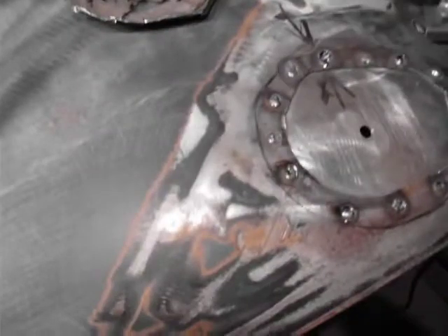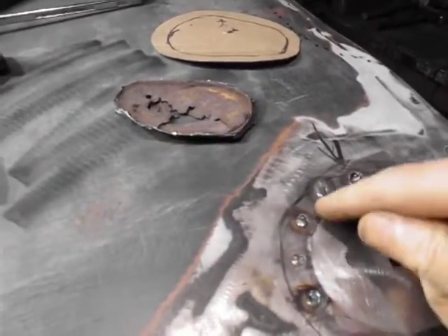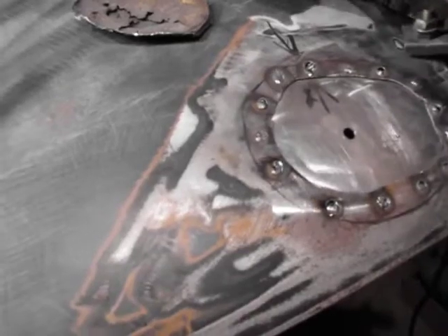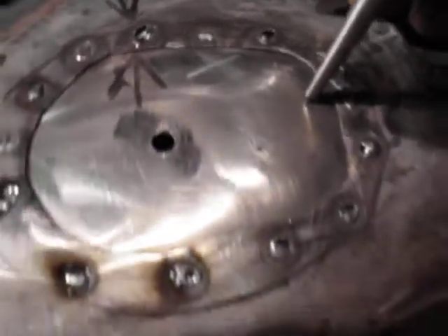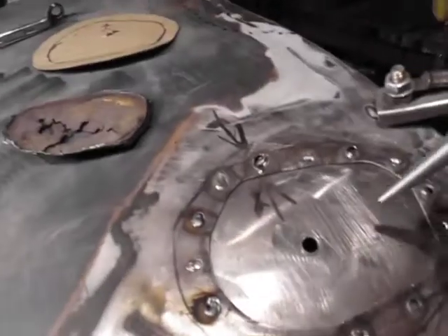What we're going to do is make a new piece that fits in here. There's a nice little template I can probably cut out and get pretty close. If we get it pretty close, we can come in and just tack it. This hole will be covered up because there'll be a new piece of metal on there. This stuff is just too rusty — it was welding because I reached the welder in and got the clean stuff, but it managed to get some of the bad stuff. There's a spider web there I don't dare touch again. I'll grind this all down, make the new piece, tack it in, and then filler time.